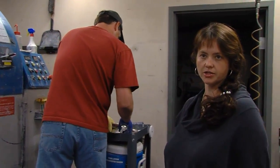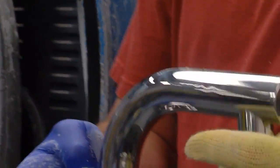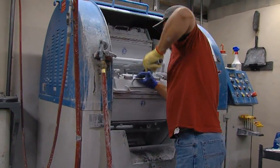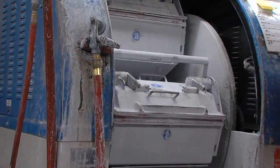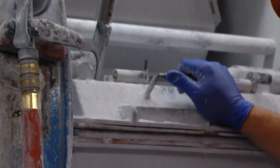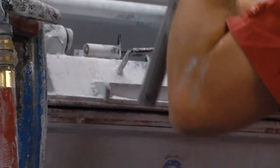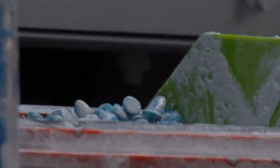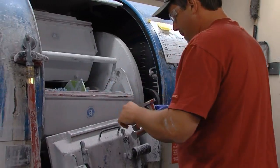Versus having a human at the polishing wheel spending a couple of hours trying to polish it — and even then getting an inconsistent process with lines and divots. We bought this machine in 2007. Before we had it, on this particular part we would have to polish it by hand on a polishing wheel for hours and hours. The original reason we bought it was for a deburring application — a military defense contract that took about eight hours of deburring. We accomplished it with about an hour in the tumbler and an hour of handwork, taking it from eight hours to two hours. This machine paid for itself within about six months, and we bought it just for one part — now we use it for probably 50 different part numbers.